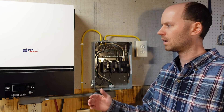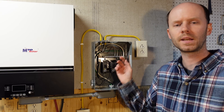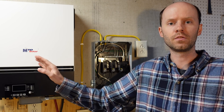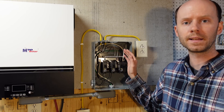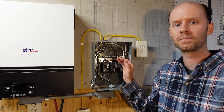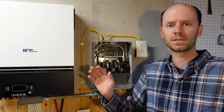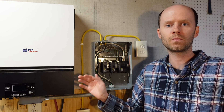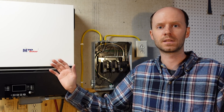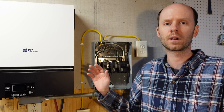A question that was asked is: why would you want to remove the screw from this inverter and then make the bond over in the panel, when you could simply keep the neutrals and grounds separate and leave the bond in the inverter? Here's the problem. If you leave the bond screw in the inverter, you have a neutral-ground bond in the inverter. And if your panel also has the neutral and ground bonded, now you have a bond in two locations — both in the inverter and in the panel. That turns the green ground wire running from the panel to the inverter into a current-carrying conductor, which is very bad. That ground wire is supposed to be a low-resistance fault path only. You never want it carrying current, which is exactly why we only have the neutral-ground bond in one location.